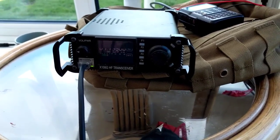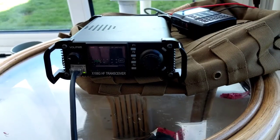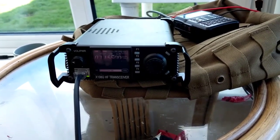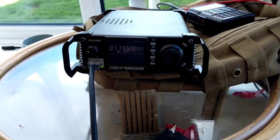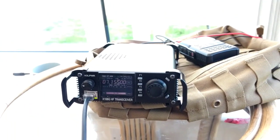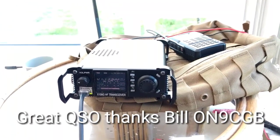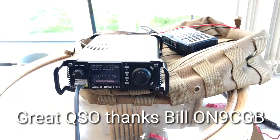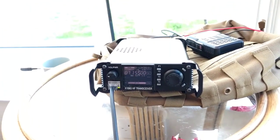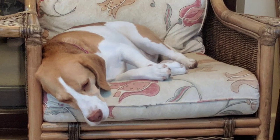Roger, Carl. For the contact with you, logging to Two Whiskey Zero Echo Zulu Tango portable is a little bit complicated on my present logging program. Oscar November Nine Charlie Golf Bravo, Richard. I think you gave me readability 5 and signal 2 — I can give you 5 by 7. So it's a little unusual — I normally receive better reports than I give. I'm running 100 watts, the antenna element is about 65 feet up.